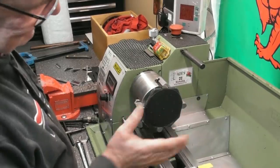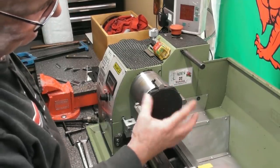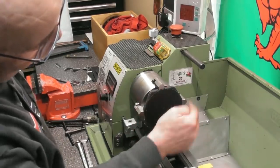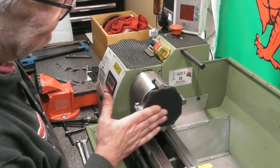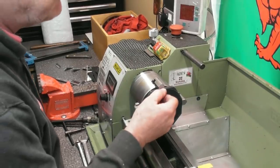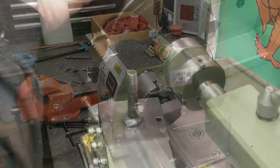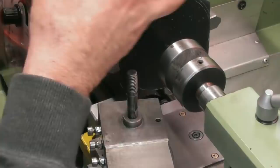I tried it in the three-jaw but it wouldn't safely open up big enough to grab the blank at about 105mm diameter, so I've gone with the four-jaw — that holds it on the outside jaws fine. I centre-dotted the plastic, drew myself a circle, hacksawed it off on four corners and knocked the corners off. There's about a millimetre sticking out all round, so I think I'll be all right with it hard back against the jaws. I'm just lining up that centre punch by eye — it's not fussy, I've got material on the outside.